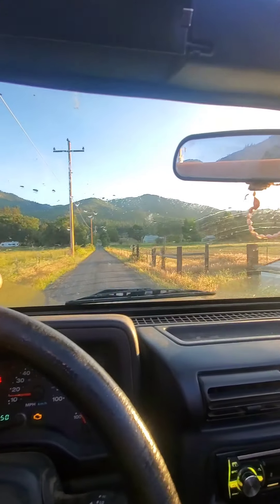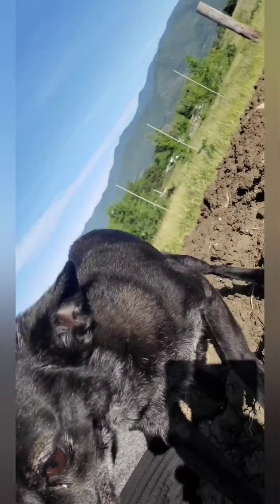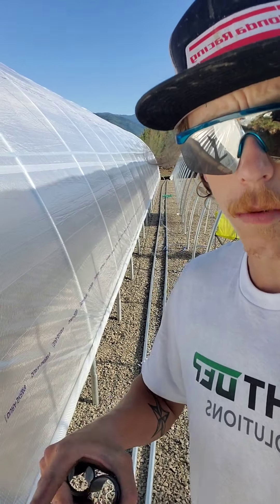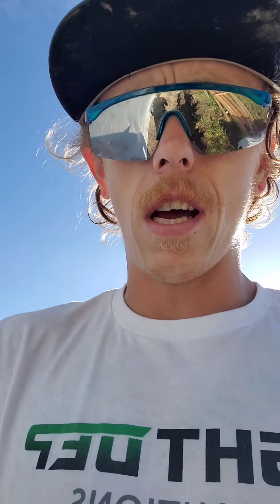Good morning — we are going to pull one clear plastic and two blackouts today. We're moving really fast today. I already got the clear roll-up sides on this one done. Every other hoop, you're going to put one of these black plastic clips — I usually do 10 to 15 per 100-footer. The clips literally just clip on. Let's go to the other side and I'll show you what it looks like after.